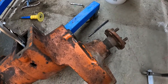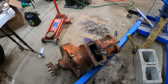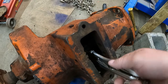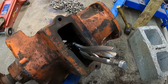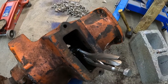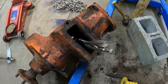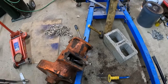Do I need luck on this or what — definitely 'or what.' I still have this Woodruff key down in here. I've got a pair of vice grips clamped on to it, but I don't have any way to put a hammer action to it. I need something I can grip around this and use like a slide hammer type of deal. I might have to make that.